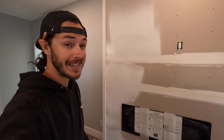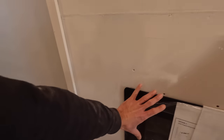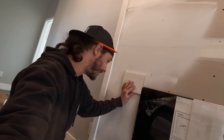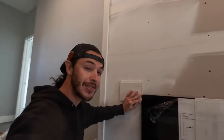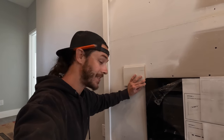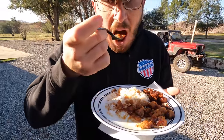That laser line is nailed it — perfect. Now I've slid the fireplace insert into place to figure out how to handle the shiplap around it. Real carpenters would run shiplap all the way behind the flange and mount the fireplace over it, or trim it out. I don't have extra trim material here and going to Home Depot is another three hours round trip. I did a quick layout and that top piece would end up being a little rip on top of the trim piece, so in the interest of just getting it done, we're going to shiplap the whole thing. Lunch time.